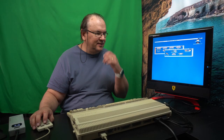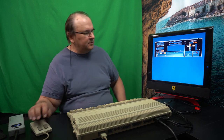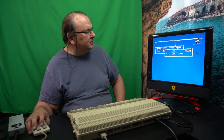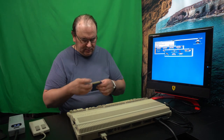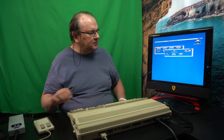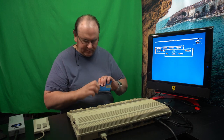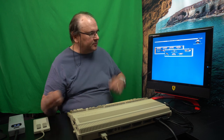So I'm going to get rid of the interlacing. It looks like for this monitor, it's not the absolute best. Where was it now? There, workbench interlacing off. I think it might complain about write protected workbench. No. Enable writing on the workbench disk. So that's saved. Oops. Put the write protection back. But usually you don't want to write to the workbench.